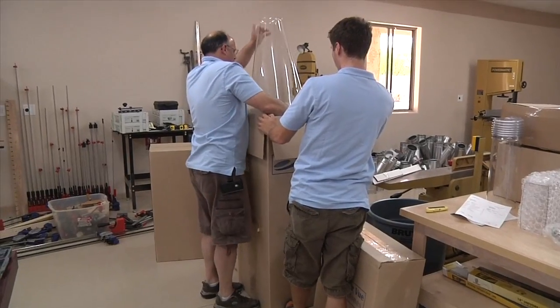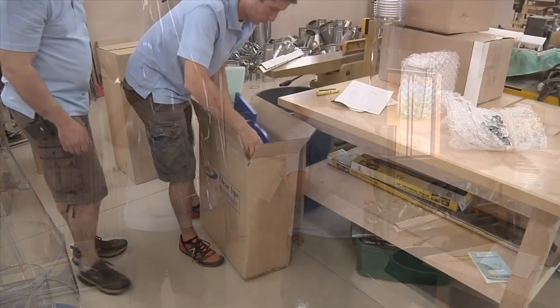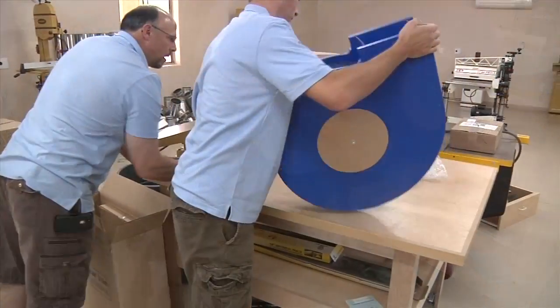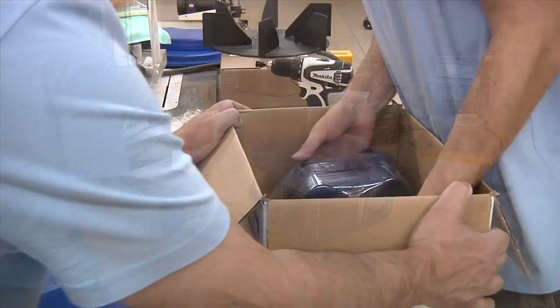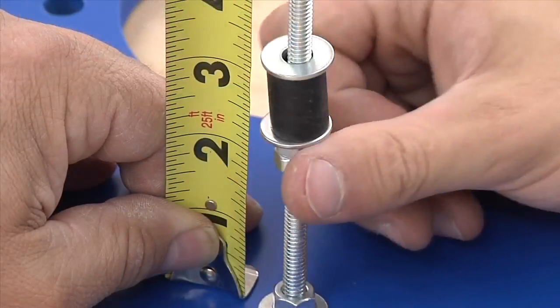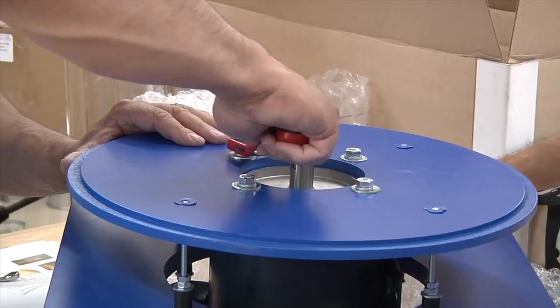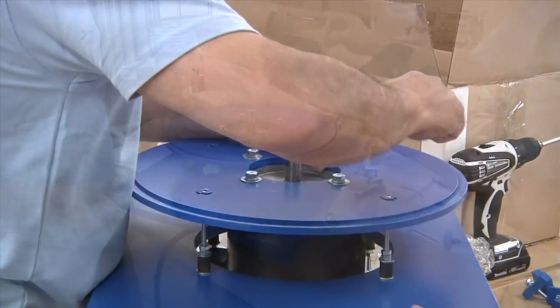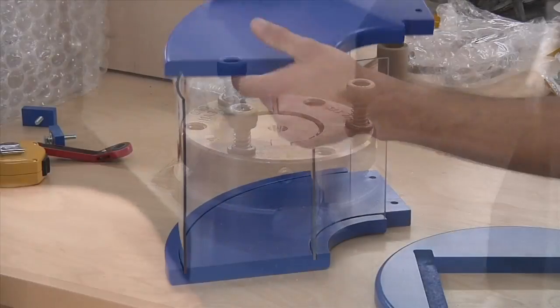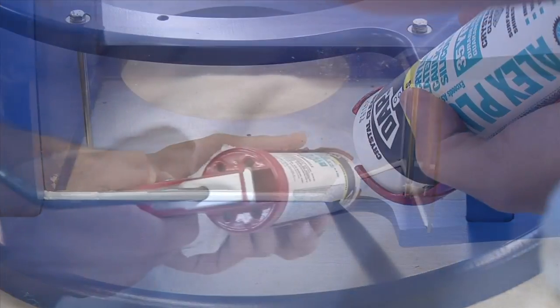While it is possible to put this together by yourself, it always helps to have an extra set of hands. The primary cyclone body is very light at about 29 pounds, and the blower housing is light as well. The 5 horsepower Leeson motor, on the other hand, is very heavy. Quite a bit of assembly is required, but it's nothing the average DIYer couldn't handle. The motor is bolted into position, and the fan is carefully installed on the shaft. The 90-degree filter transition is assembled and then caulked — in fact, all of the parts need to be caulked for a nice, airtight assembly.